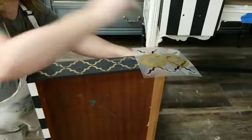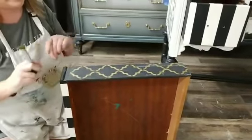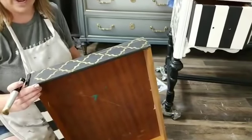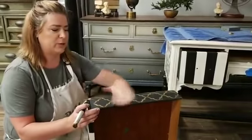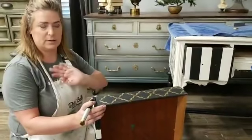So now once you're done with this and this dries, what do you coat it with? Do you coat it? I'll coat it. I can coat it with Gator Hide, any of the Dixie Belle clear coats. If you use a wax on this, because this is a wax, and you're using a wax brush, it will reactivate your wax. So I wouldn't use a wax on this, but with just a single pass of a clear coat, done.